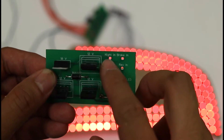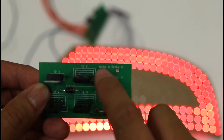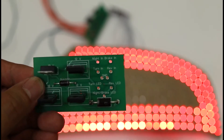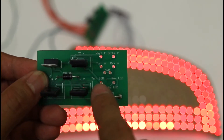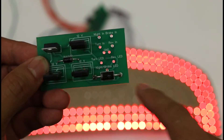On the right side, you can see night in, brake in, turn in, reverse in, and ground. This is going to be for your harness side, so your signals are going to come in from your harness into this board on the top section. For the bottom, where it says turn LED, reverse LED, night or brake, that's the input into your board.